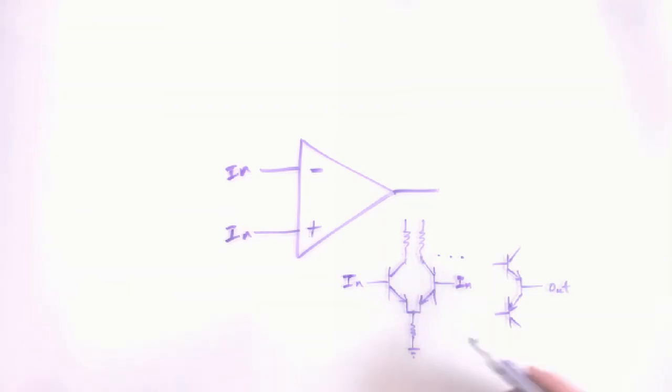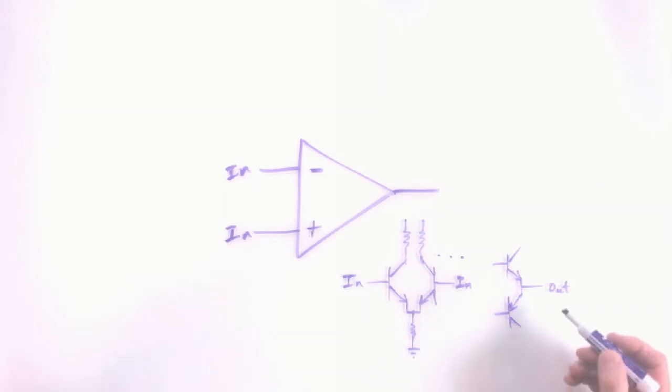The signal works through some circuitry — maybe a second stage — with things like current mirrors, constant current sources, and active loads. It's constructed to be a really high gain amplifier. With a long tail pair you already get a good jump start on high gain, and with active loads you get even higher gain. The output many times comes right from something we'd recognize as a familiar push-pull output stage.